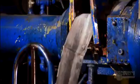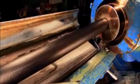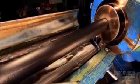They start with a wide flat strip of partially processed rubber. A hot extruder forces it through a series of holes. This transforms the rubber strip into a narrower, rounder form. The rubber falls between hot cylinders. They roll it thin and soft like pie crust.